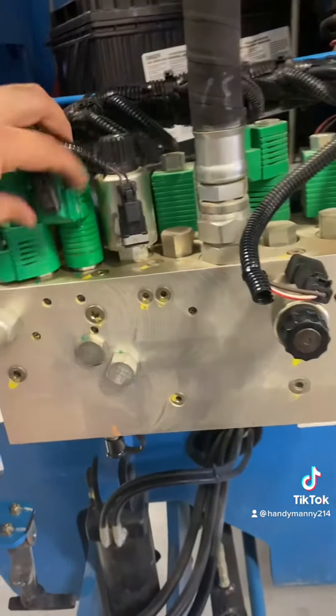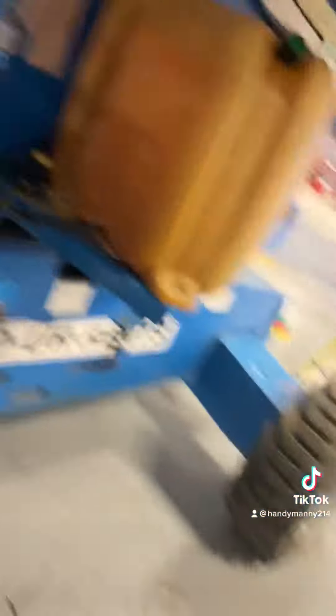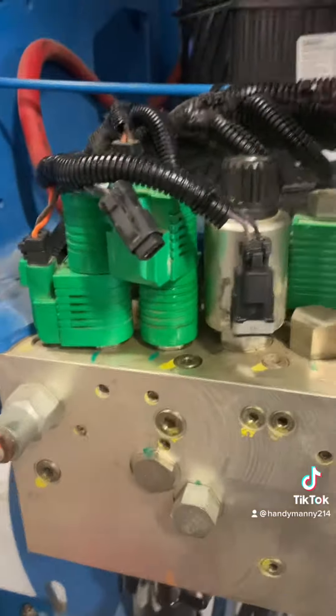Check them. I got power 12 volts going to each one of these. Check the magnet on this. Y'all see those pins? I got my little jumper here. Put my right one, my positive, my negative in there, hook it up to my battery, send 12 volts directly. I put a little flathead screwdriver on there and it held right through. My coils are magnetized and everything's working good.